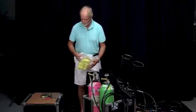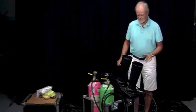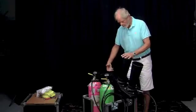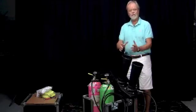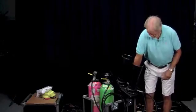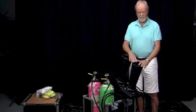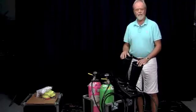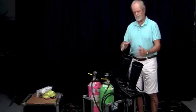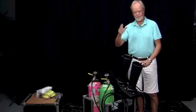There's one thing I want to point out to you before we put the product into the machine. Your horns, this is an interesting situation. The back horn is actually over the hopper. You put the confetti in the hopper and that horn sucks it up. The confetti is coming out of the back hopper only. The front hopper, and we'll show you this a little bit later in a close-up, hangs off the front. It doesn't go over the hopper. And the whole idea behind the front horn is it's just moving massive amounts of air, not being slowed down by the product itself. The two horns will join each other about this high, and that confetti just takes off like warp speed on Star Trek.